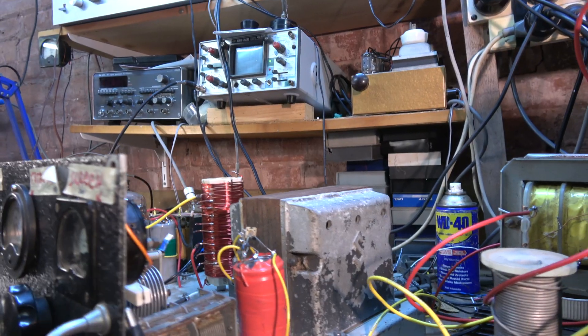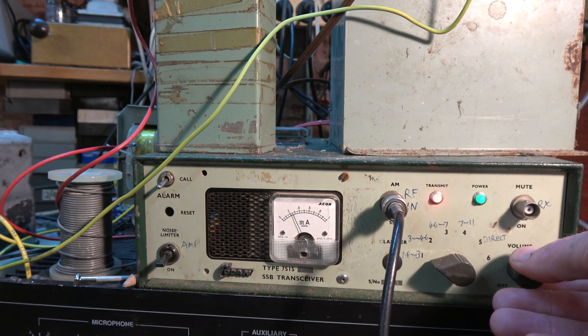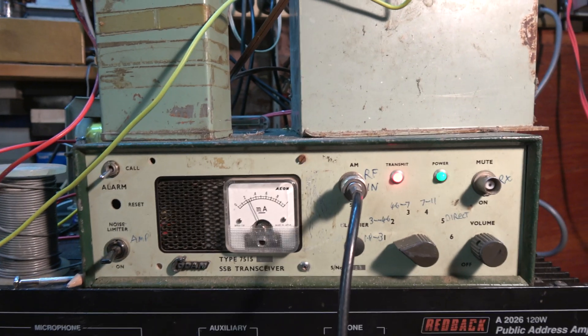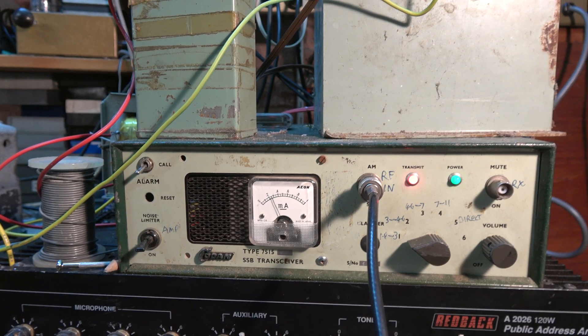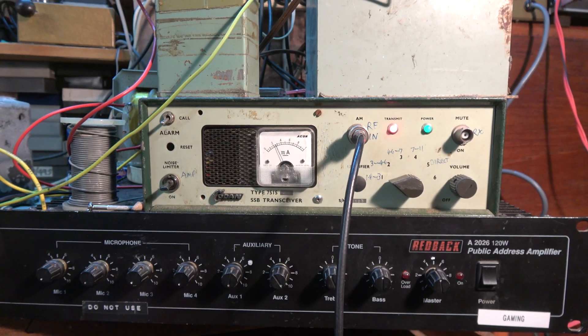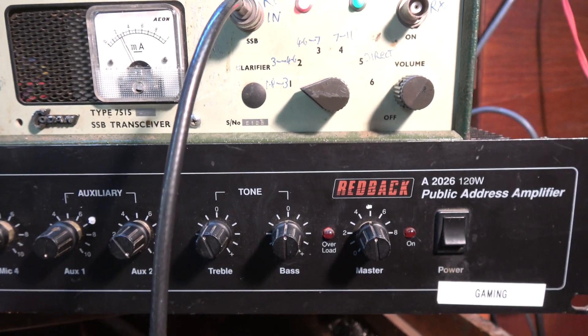This is just the power output stage — the final stage. I'm using a Codan linear amplifier to give me a few watts to drive the 813. These Codan units are capable of 100 watts SSB or 100 watts carrier — pretty good devices. A few watts out drives the 813, and for the audio drive for the modulator I've got a public address amplifier, about 120 watts, feeding a 100-volt line output.